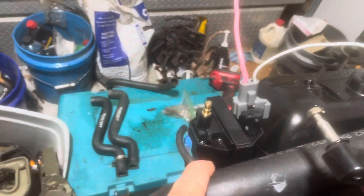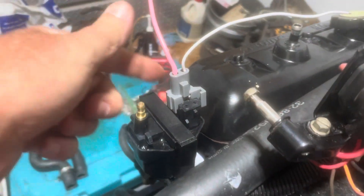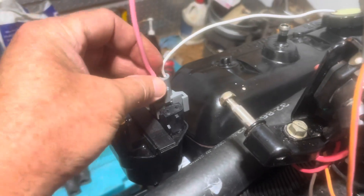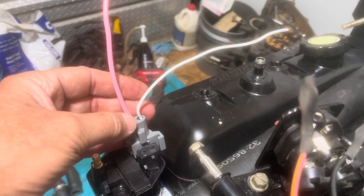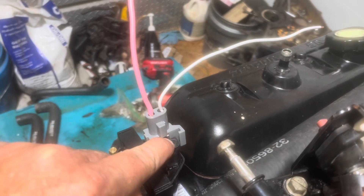The first thing you have to do is power your coil. This is a new ignition coil mounted on the back of the cylinder head with a custom bracket — everything is rigidly mounted. This is your power connector to your coil. The pink wire is hot 12 volts into the coil. The white is the negative wire out to your tachometer. Internally the white wire and this pin here are connected together.